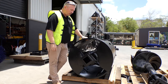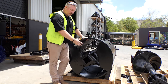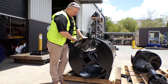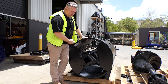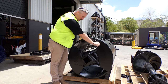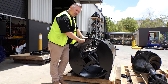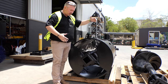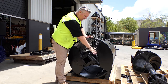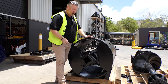Let's have a quick look at the top end of the core barrel — it's just as important as the business end where the teeth are located. There's a lot of design work and engineering gone into the top of the barrel; it's not just a hub on a piece of plate. We've designed a nice key shape, giving you access if you've got to drive that core out. It's heavy-duty plate with heavy-duty supports underneath, so it'll take the push-down of your machine, especially on larger diameters where the plate would otherwise be unsupported. We've got heavy-duty gussets on the heavy-duty hub. That's what you need in a core barrel.